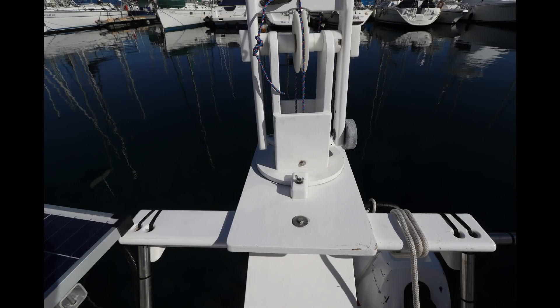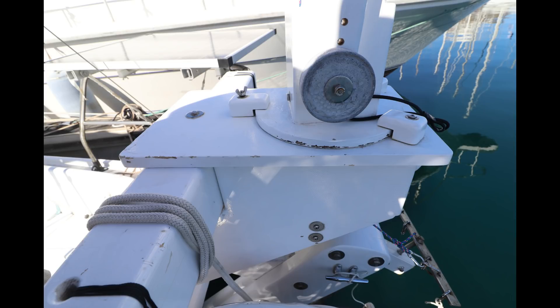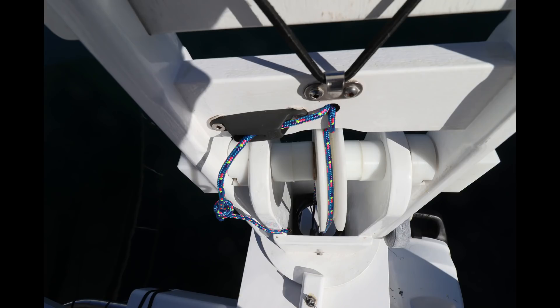When assembled, note how the pedestal is connected to the base. There are three connection points — all three are pieces of hardwood with a tiny amount of clearance to allow the pedestal to turn within its radius. Looking down through the pedestal, there's a four-inch diameter piece of ABS sewer pipe. The pedestal was designed around that pipe so it fits tightly inside. That pipe also has supports underneath the base to keep it centered, so when you turn, it's the ABS rubbing against the Teflon supports underneath.